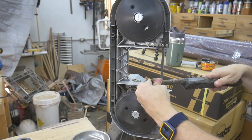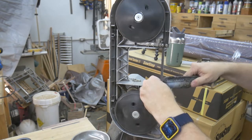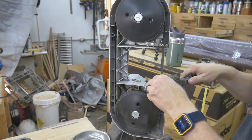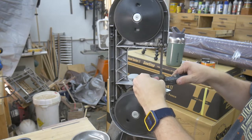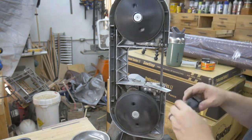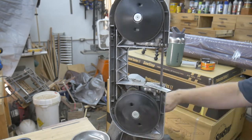There are some drawbacks to melting this type of metal. First, I'm not sure exactly what the alloy is, so I will be guessing on the melting temperature. Also, this bronze is old, dirty, and corroded. Those factors will likely lead to longer melt times and will contaminate my pour. I will probably need to remelt this bronze a couple of times to refine it before I could ever use it to cast.